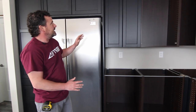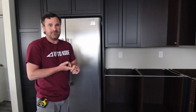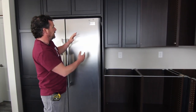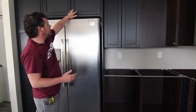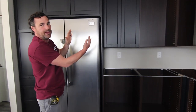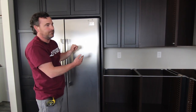For today's video, it's about A) making it look custom, making it look finished, and giving yourself enough width as well. Most fridges nowadays are bordering on around the 36 inch mark. Now if you just took the 36 inch cabinet and put two gable panels on there, your opening would be exactly 36 inches, and that's too tight for a fridge.